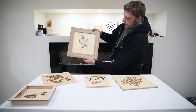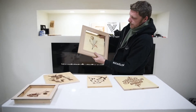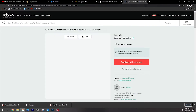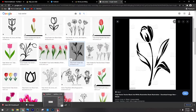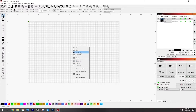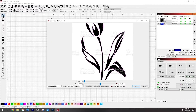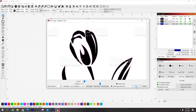I've got today's one on video — not the frame, that's just a simple frame. So first I just went to Google and picked something that had an outline like this, went with something pretty simple so the video isn't too long, then just copy that image. You can actually copy it right off Google, then paste it into Lightburn. Left click it and right click it, then select trace image. Just make sure it's done a pretty good job — yeah, that looks good — and say OK.